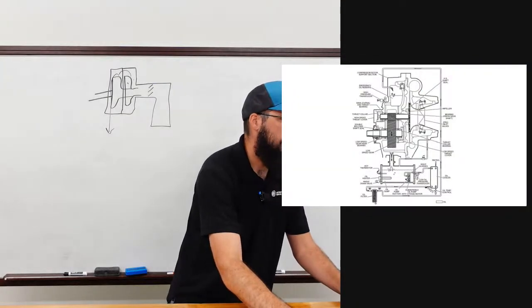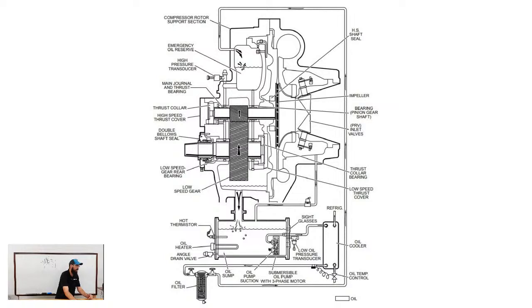Yeah, here you go. Here is a York design. I don't have a pretty picture of it. But what you're looking at is a breakdown of the chambers inside of a P-Series York compressor. On the right side of that depiction, you're seeing the suction inlet about two-thirds of the way up. That's where the refrigerant is coming in.